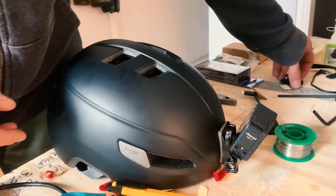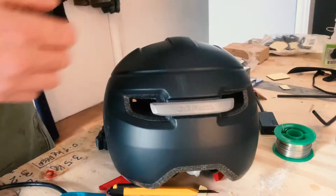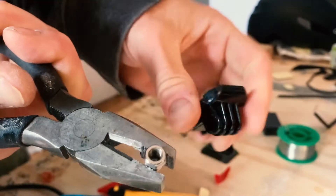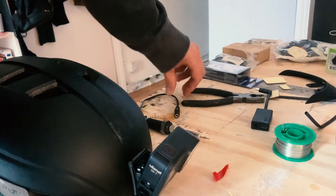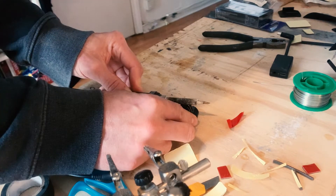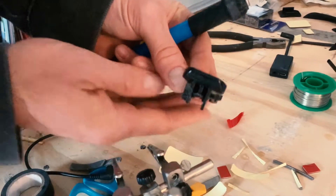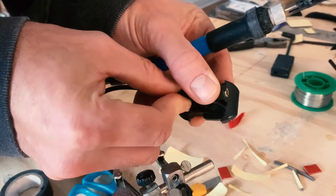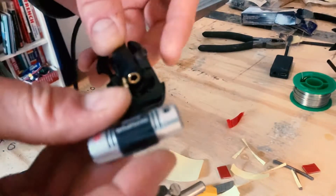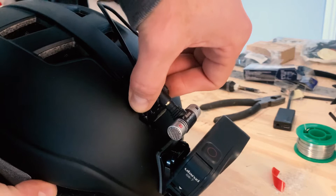Next is to position where the microphone will go — around about here, or you can put it wherever you want, maybe even on the back. Next is the microphone mount. Get that out and then you will need the soldering iron, which goes in here like so. Get your soldering iron out, push it down in the middle — takes a bit of time to melt. It's at a nice angle and once melted it should be perfect for this to fit into. Next is to get your microphone out. This will go in here like so.